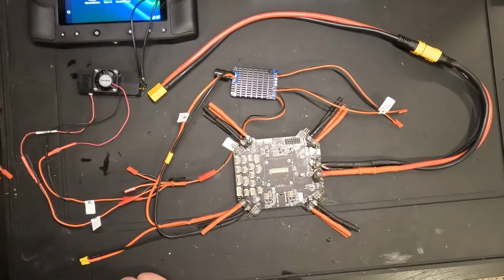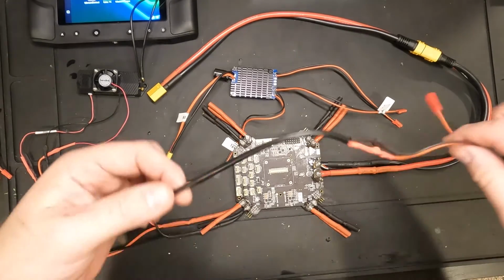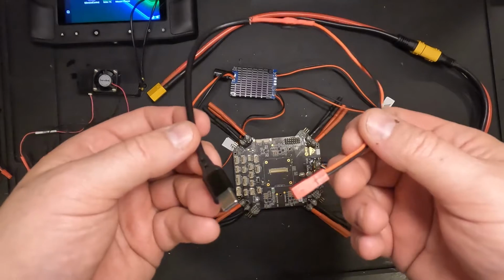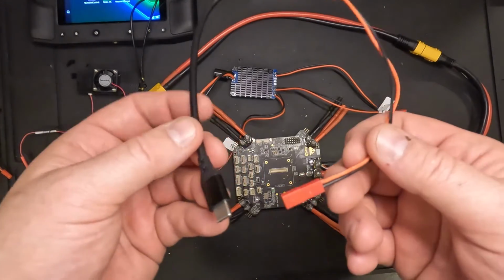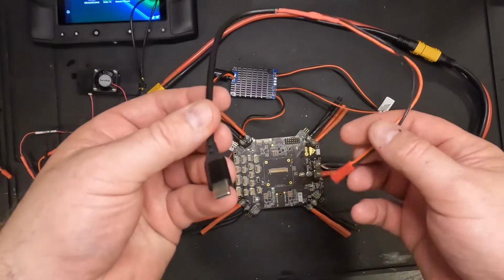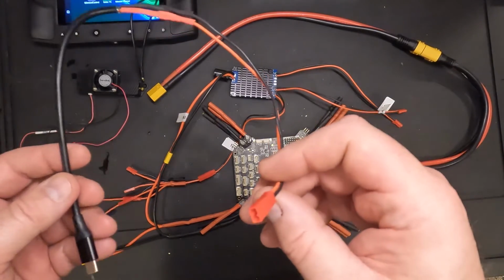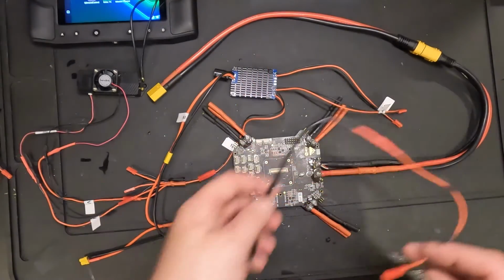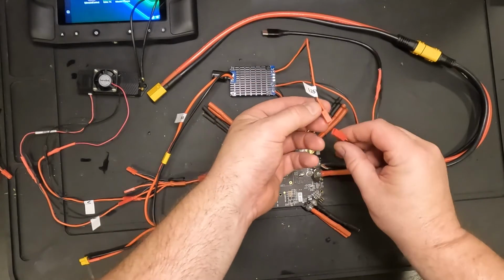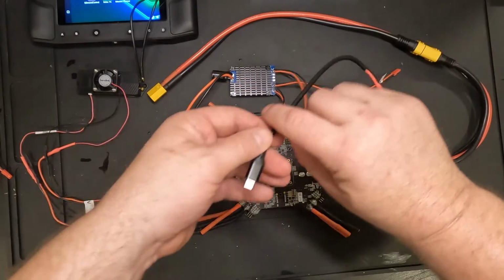In a future video I'll show you, but I also made a USB cable. I bought one of the USB-C up to 5 amp cables. You've got to be careful. There's 3 amp and 5 amp versions, it looks like. So I had to hunt around a little bit for this type of pigtail connector. So I got that, and I attached my other end of the connection that's going to go to my octopus cable. And that ultimately is going to end up going into this 5 1/4 volt 15 amp connection. So that'll give me a good USB-C power source to go into my Raspberry Pi.